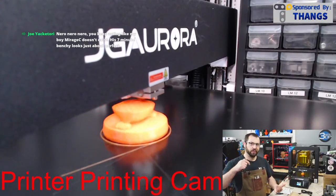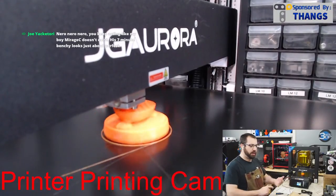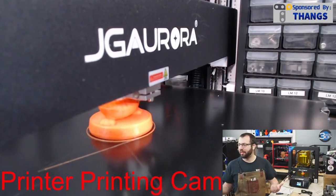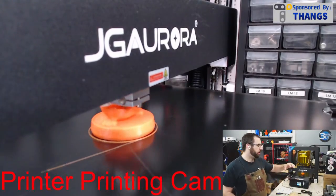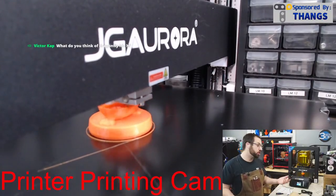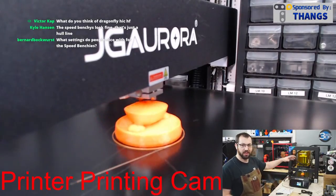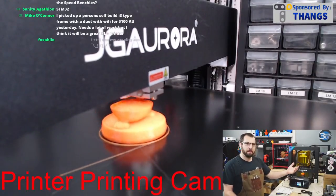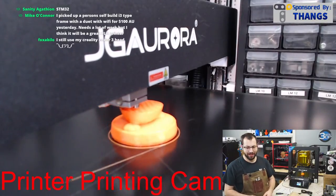And that's running everything on a single board. A lot of people have the, oh, it's got to be on one board. You're limited to 130, 140 megahertz STM processors, or M4s, or whatever the Duet's using, 300-400 megahertz. At least now with Klipper, we're able to harness the power of a quad-core Raspberry Pi to do whatever the heck we need it to. Because that's how CNC machines run. Outside of 3D printing, CNC machines all run with a controller running Linux, running the machine, and everything's hooked up to that. So we're finally getting to that point.